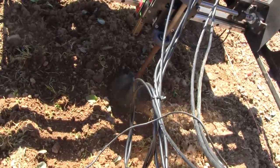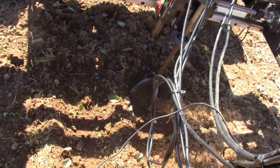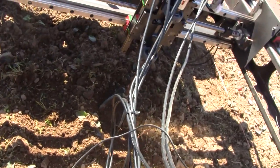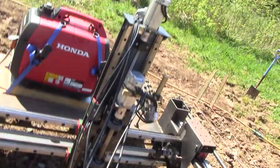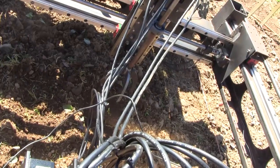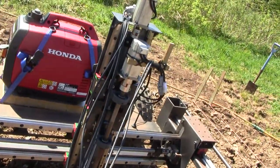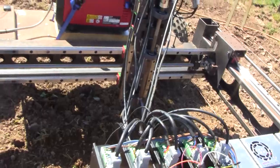So if I stop this now, I can demonstrate the Z axis. I've got to be a bit careful, because if I bring it too far the claw will interfere with the metalwork. That's the X axis — this is the Z. There she goes, the Z axis. I can bring that up, but they can't go too far because the claw will interfere with the steelwork there. Unfortunately it's got an optical encoder, so I'll be able to position that so the claw is out of the way. There it goes — you can drive it away now, that test is finished.